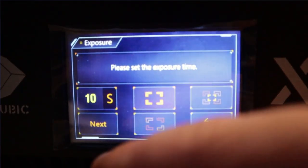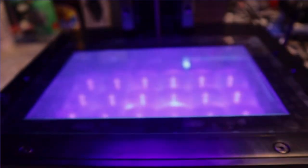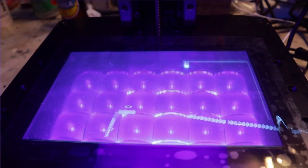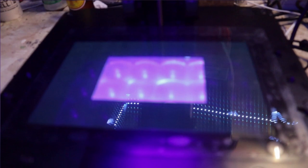Next step is going to tools and the detection setting. Check that the screen, masking, and UV array are working correctly. Going through the three options, choose the three masks of an entire screen and partial screen — 10 seconds and playing exposure. Top left is UV fully on. Bottom left is fully masked. The right option is the outer edges masked, exposing the center. I use this to test if a screen is working correctly as a yardstick.